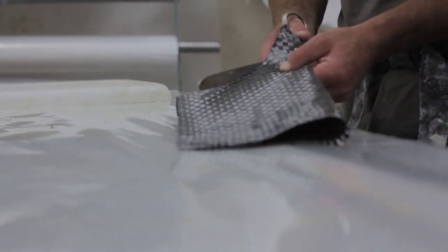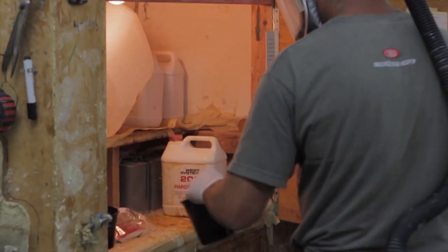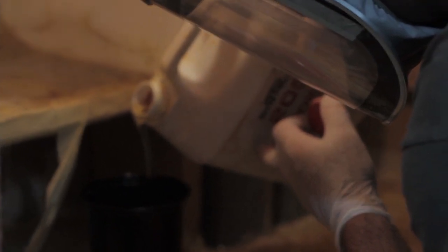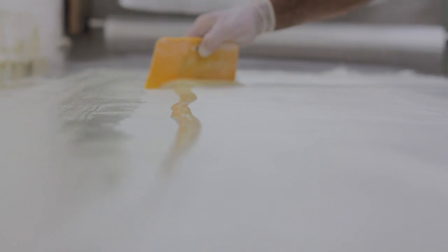So what we basically do is take our EPS blank and wrap it in high density foam, starting to create a structure around the shape. The laminate bonded to the 5mm sheet of PVC is made up of glass fiber and a carbon thin patch to take the high load in this area.